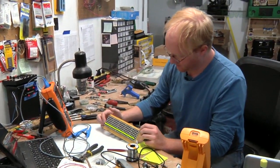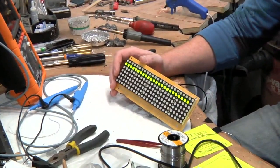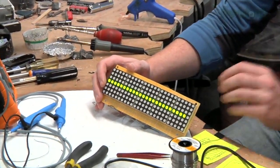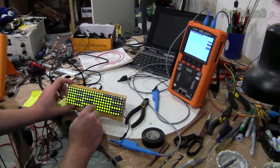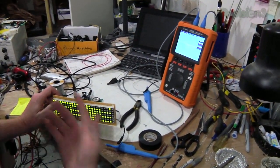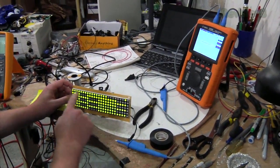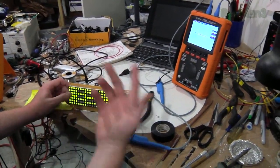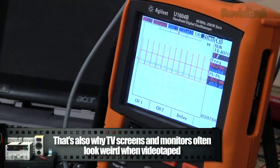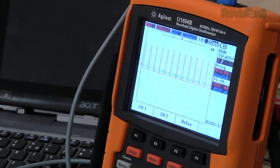The Johnson counter is being pulsed and activating the rows. Right now we're just sending all ones — all high — but you can see how the rows are being addressed. If we take out the delay it'll run full speed and appear to be solidly on, although not terribly bright until we run it in machine language. Now with the program written in machine language it's a bit faster. With the Propeller's multiple cores, one core can sit there pumping data out while the others keep track of time, make graphics, and generate digits. Each row of LEDs lights up at approximately 60 hertz — faster than the eye can see.